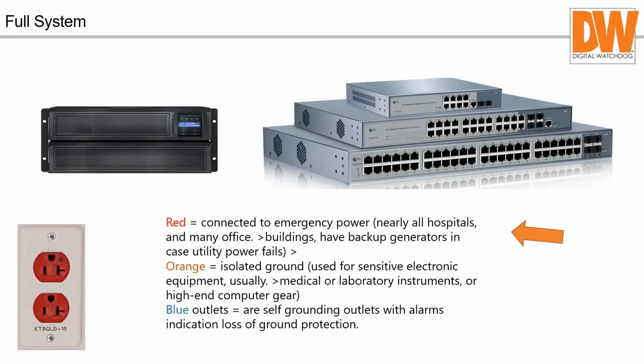There we go. So a full system is not just Spectrum servers and boxes. It is power, okay, and as you're switching. I would tell you to go out and pick one brand of a switch, familiarize yourself with it, and that's the one you use on every site. Make sure you're putting a managed switch even on a smaller site, because if there's something going on there, you can go look at the logs of that managed switch and really see packet errors because of camera X or wiring. Some of these switches will tell you that you have a bad cable and where it's bad at. So good idea to do this.